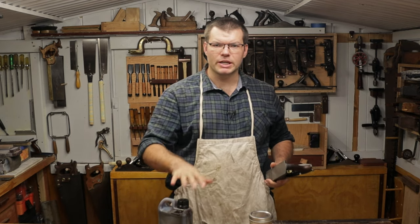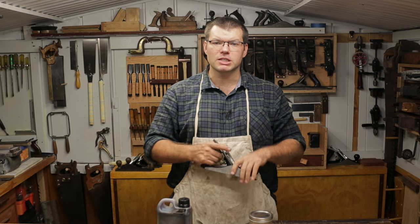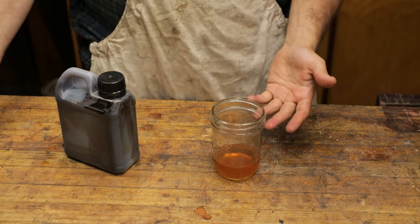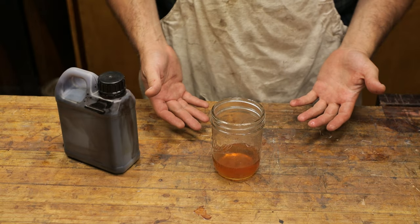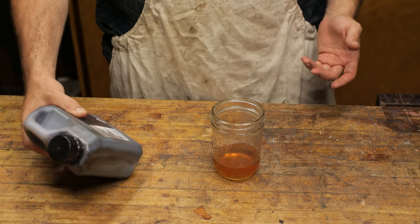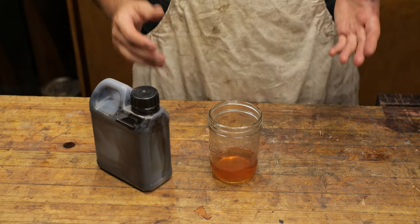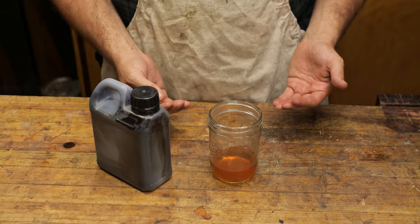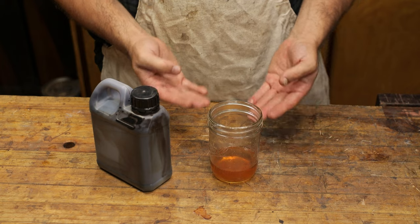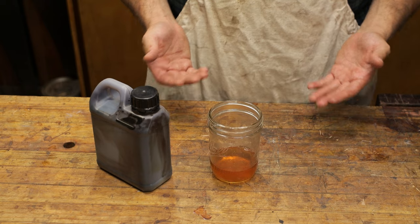Let's bring it in here and I'll show you how to mix it up, and then we can do a test piece on a bit of pine so you can see the colour difference. What I've got here in this jar is just a little bit of two-pound shellac. That's commonly what I use for the totes. If I want it to cure a little faster, one-pound shellac and a few more coats actually works well. You need very little dye to actually tint this — if you accidentally add too much it's going to make it darker, so you can choose how much dye you want based on the desired colour for the tote, handle, or whatever you're refinishing.